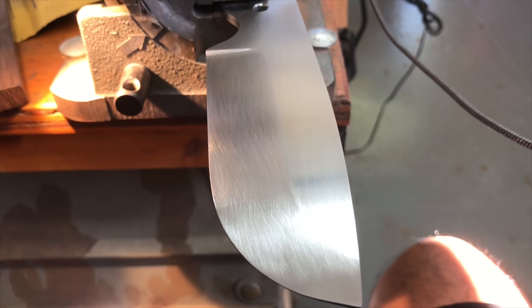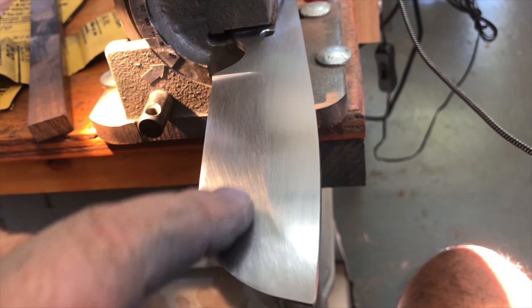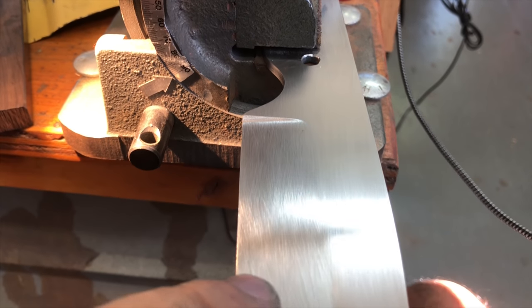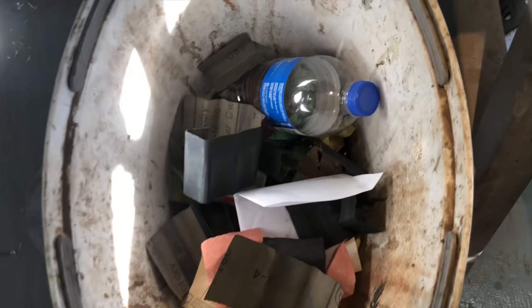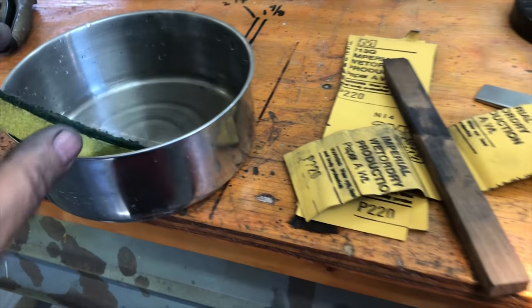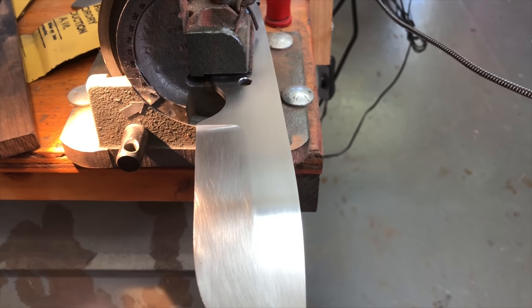All right. I got the scratches rubbed out — let me move this light a little bit. I got the grinding scratches rubbed out on both sides, and now I've got this sanded up to 220. Starting to look like a knife now. I got the divot rubbed out too. That took some doing — a whole lot of sanding. I'm gonna do a little more 220 on each side, wet this time — I've got a bowl of water here. Then I'm gonna move up to 320, and I'm gonna go all the way to 600 with this.